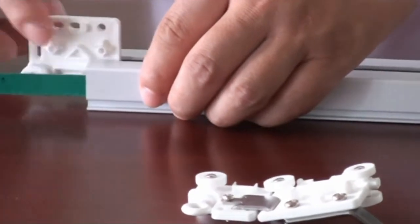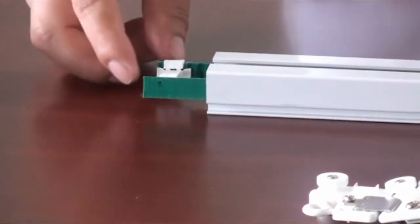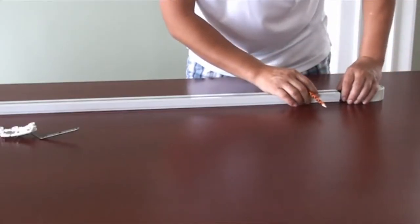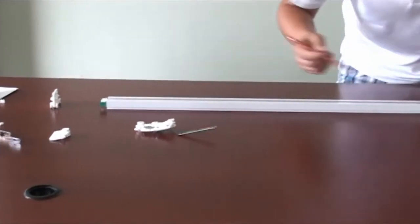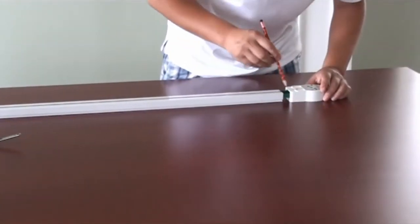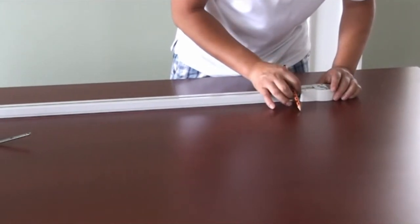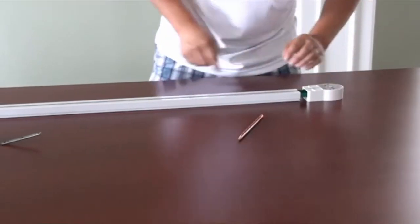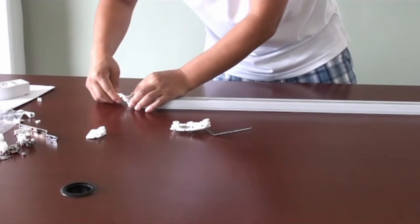You can also choose to do the following steps without the master carrier on, as some people may find it easier. Slightly move the drive unit away from the track and align the drive belt ends again. On the opposite belt of the master carrier part 1, use a pencil and mark the belt where it is aligned with the edge of the drive unit. If you haven't inserted the master carrier yet, do so now.